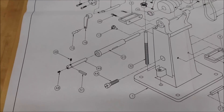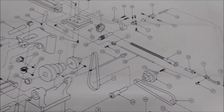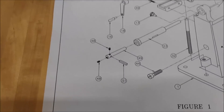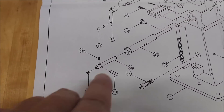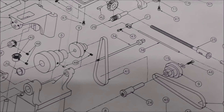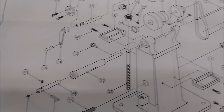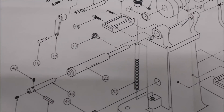Joel Pie here at Advanced Innovations — welcome back to the shop. As I proceed with this mini mill kit build, I'm going to make a couple of changes to the spindle. This is a very mild taper and there's no drift area to knock this thing out. A slighter angle means greater potential for taper lock, and with an 080 thread, 062 diameter, 80-pitch draw bar, you can't just unloosen it and smack it free. Perfect opportunity to change things up.